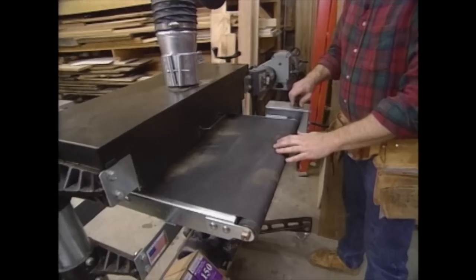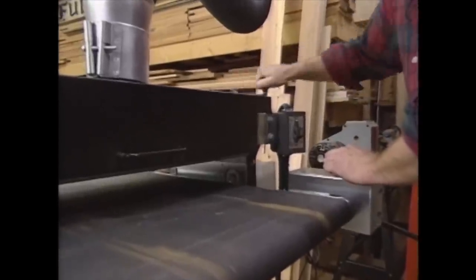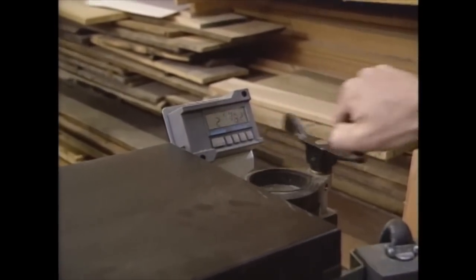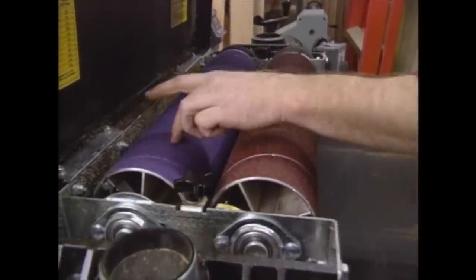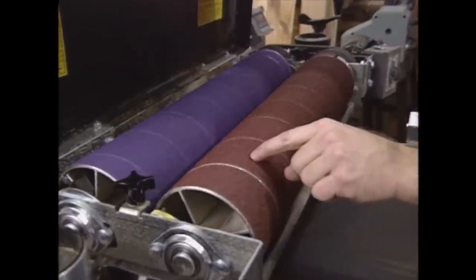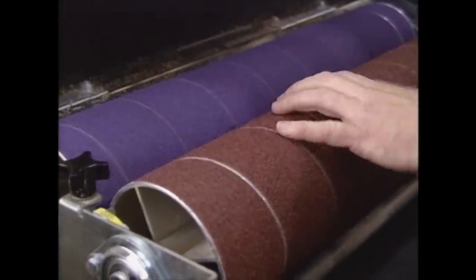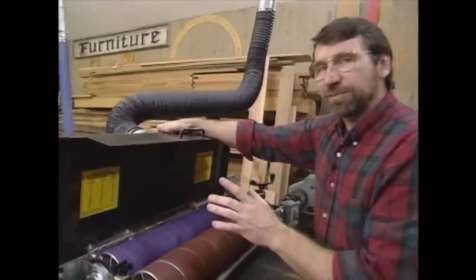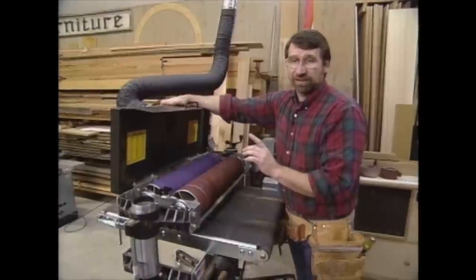The conveyor belt runs the material through the machine, and the whole bed can go up and down, giving me a range of 0 to 12 inches. There's also an electronic readout which gives me very accurate settings for thickness. Underneath this hood is where all the work takes place — there are two drums, and you can outfit them with all different types of sandpaper. I'm starting with 36 grit, finishing off with 50 grit on a drum that's slightly lower to start to smooth the board. Because this is a sanding operation, you make a lot of fine dust, so you need really good dust collection. With a surface planer you can take off a sixteenth or even an eighth of an inch per pass; with this you should really only take about a 64th, but with patience it does a good job.